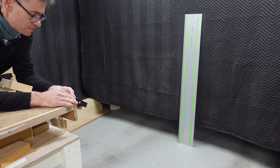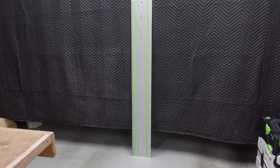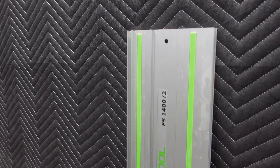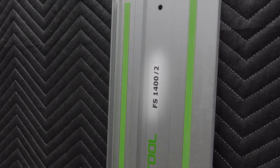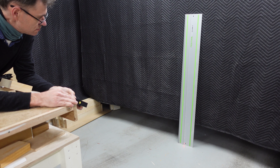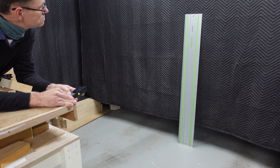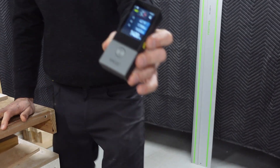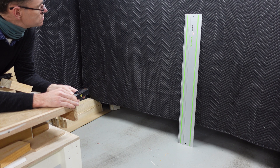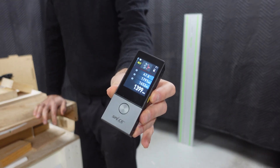Auto-vertical height is similar to auto-horizontal distance in that you can measure something indirectly or if you can't physically get close to it. The trick with this one is that you need to keep the back end of the D9 Pro in the same position when measuring, because you're effectively measuring an angle — if you move the vertex of the angle around, you'll get an inaccurate measure. In this example, I'll measure the length of this track saw guide rail. I know the length is 1400 millimeters and it's also written on the guide rail. By using the corner of the bench, I'll align the D9 Pro and point it at the base of the guide rail and take a measurement, then repeat that step for the top of the guide rail. This measurement was surprisingly accurate — on this one you can see it's exactly 1400 millimeters, which is quite incredible. I did this a few times and didn't always get exactly 1400, but it was always very close. This second one is 1399, which is so close.